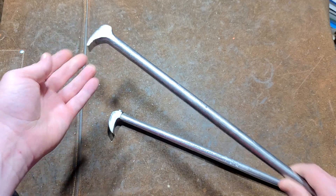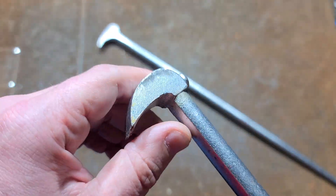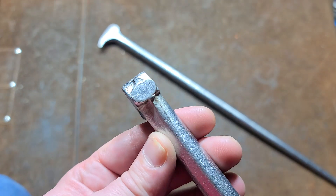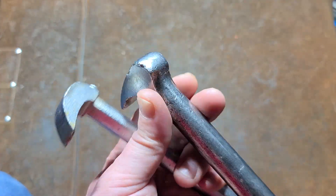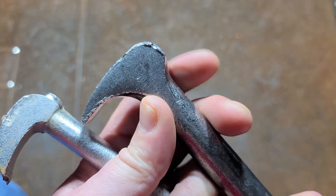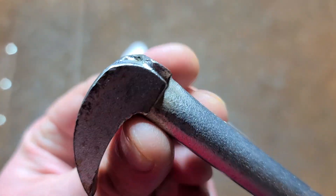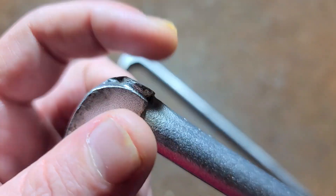So this one needs just a little bit more of an angle to get at whatever you're trying to get at versus the old Snap-on. It's kind of an interesting hook design — doesn't seem to be quite as strong as a Snap-on, but still plenty decent. What they've done — like how the Snap-on has this flare as a big impact surface for hammering — since they left it thinner on the Craftsman, they appear to have left this nub specifically as the impact surface.